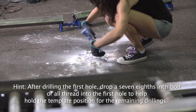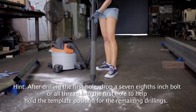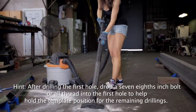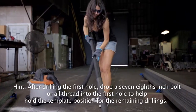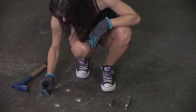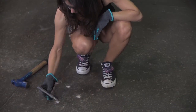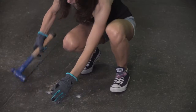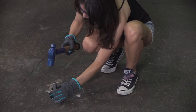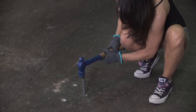When all four holes are drilled, thoroughly clean all cement dust within and around the holes with a vacuum and/or air hose. Drop an anchor into each hole with the female thread up. Use the provided setting tool to set the drop-in anchors, and hammer until the setting tool shoulder rests on the anchor top. Complete that operation at all four stanchion locations.